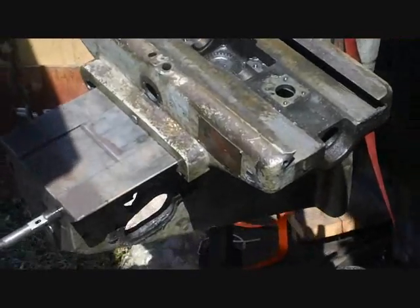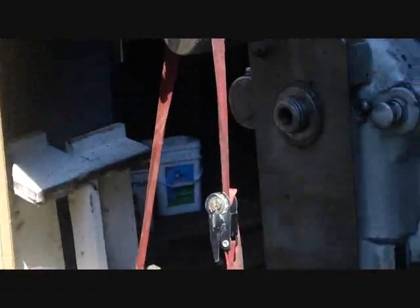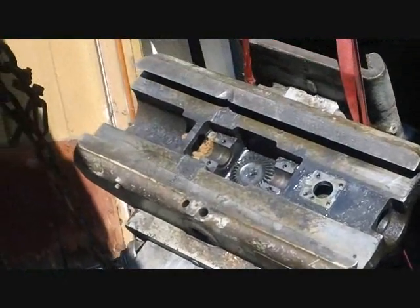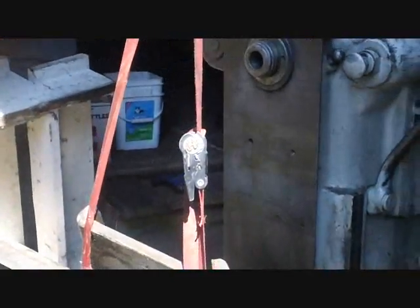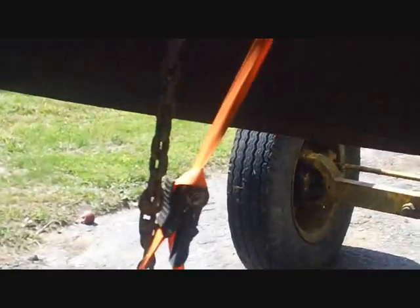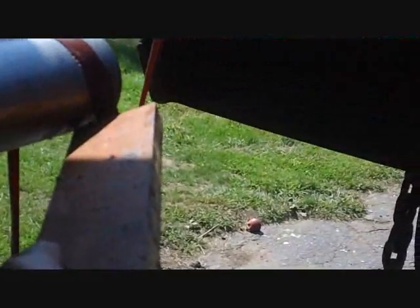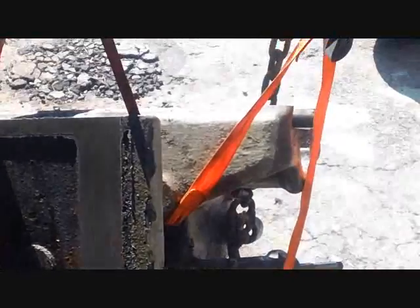Now I think if I lower it down so that it's touching the ground I might be able to undo that strap. I can't lower it down far enough, so I'm going to reattach my other two straps towards the rear and then let that other strap loose. I've got these two straps out, but that's still going to want to swing down and back towards the loader, so I'm going to get a push stick forward and slip this off the strap — that way I'm safely out of the way when it swings, especially if the strap snaps.